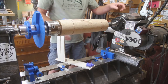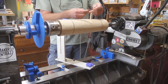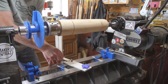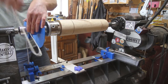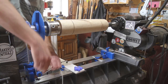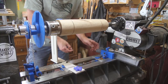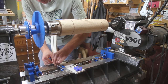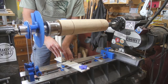Now for the chain — this is what runs the sprocket and everything. It has little hooks on it right there; you just put those right onto that little pin. Run it right along the guides there, lock it right in like that. Make sure everything's tightened down. The way you tighten it is just turn the little cup here — you can move it to the next ball. It doesn't have to be really tight; it's just going to rotate as you go. And this is the indexing wheel here.